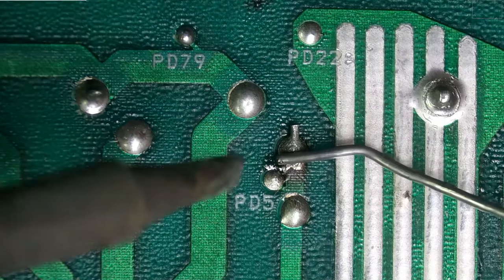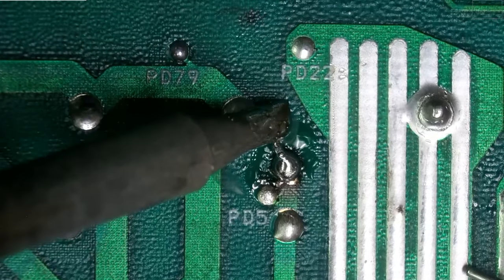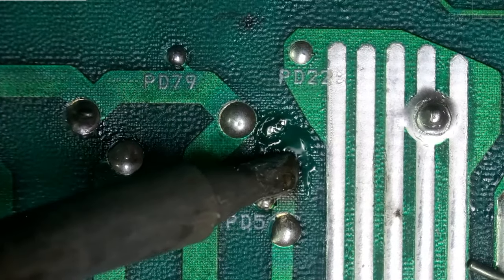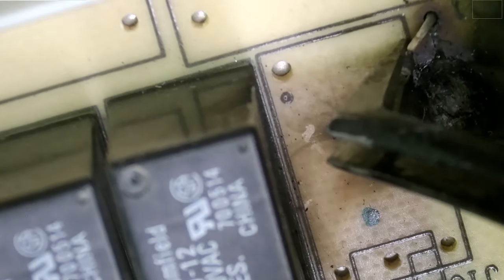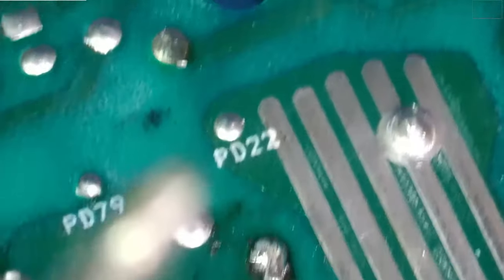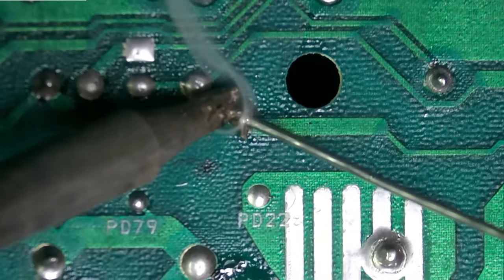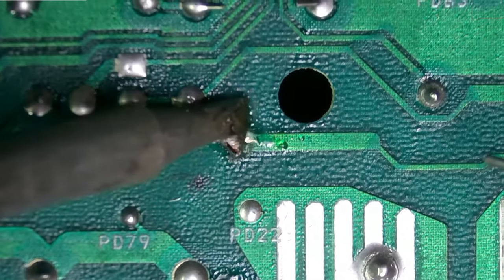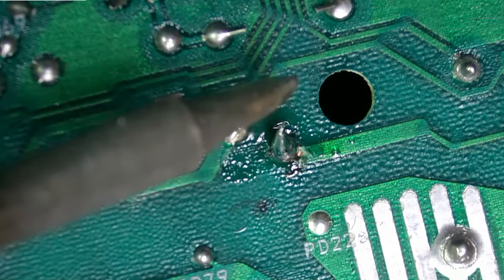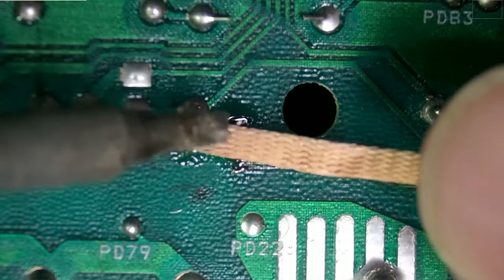The first thing I'm going to do is add some fresh solder to get good flow, and I'm going to try and push that pin through. I'm going to grab the pin from the front side with my tweezers, and then at the same time, desolder from the back side. There we go — that's our first pin, and our second pin over here. We'll go ahead and clean off the excess solder with the desoldering wick.